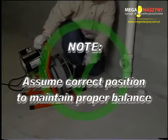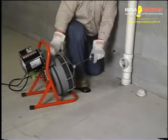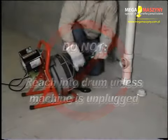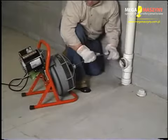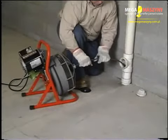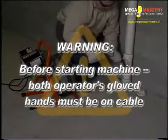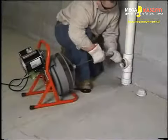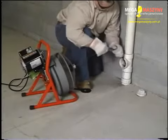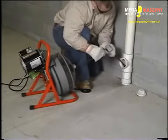Always assume the correct operating position in order to maintain proper balance. Be sure you can quickly remove your foot from the foot switch. Your hands must be on the cable to control any possible twisting action when the cable hits an obstruction. Keep hands away from the rotating drum. Do not reach into the drum unless the machine is unplugged. With the machine in the off position, manually pull a sufficient length of cable out of the drum to start the tool and cable into the drain as far as it will go. Move the forward-off-reverse switch into the forward position. Grasp the cable with two gloved hands and pull approximately one foot of additional cable out of the machine, forming a slight loop of cable between the machine and the inlet. Before starting the machine, both operator's gloved hands must be on the cable. While depressing the foot switch to start the machine, use both gloved hands to grasp and push the cable into the inlet. Rotating cable will slowly work its way into the line as you apply downward pressure with gloved hands on the cable loop. Continue to slowly feed the cable into the line a few inches at a time until resistance or an obstruction is encountered.